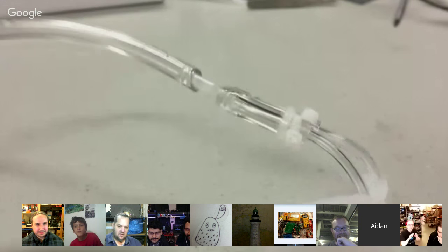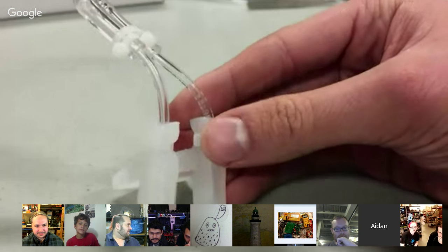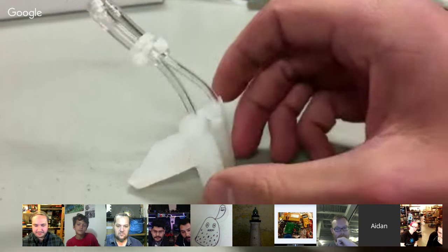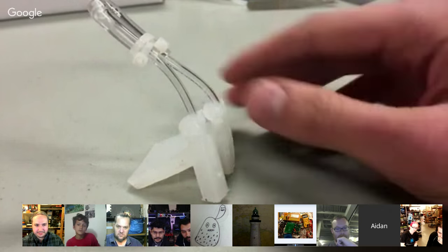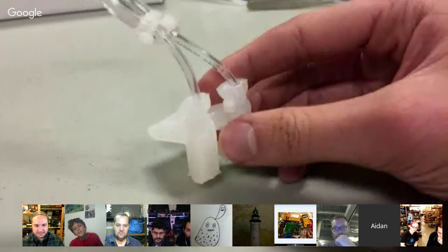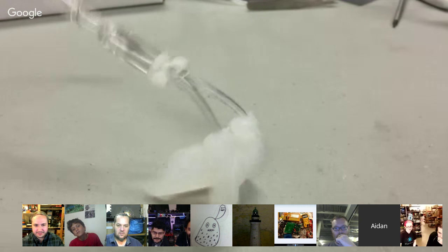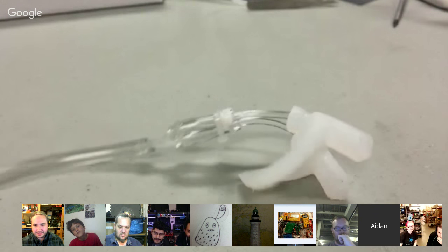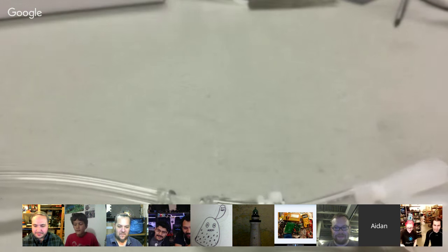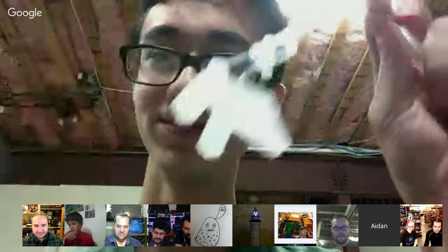It's really simple to make — you make it in one casting step. This was the mold I made it in. These are the little cores for the two actuators. The pieces just fit on top of each other. You pour it through these three holes and then remove it all in one casting step. Does it have to be two separated legs? I originally thought I'd need two air inputs, but after making it I discovered I only needed one. I was too lazy to modify the mold, so I just left it as is. Walking soft robot. You get an As Seen on Show and Tell sticker!